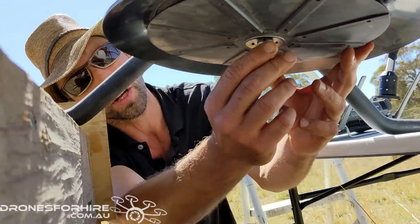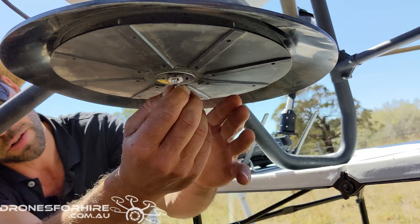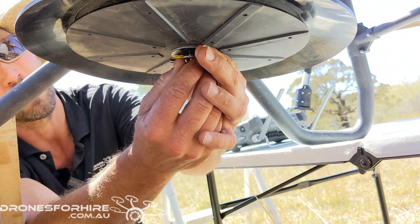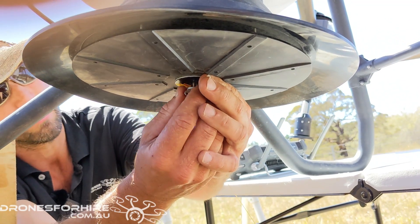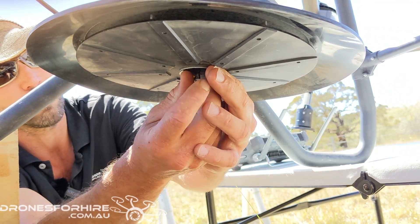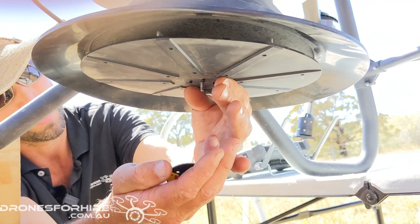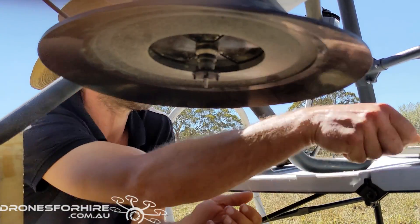You're then going to undo this wing nut. Now the wing nut is reverse thread. When you first undo it, it has a bit of Loctite on it so you may need pliers just to start it — be gentle. This process is a lot easier if you do it before you've put the spreader into the drone. You're going to remove a small washer and then off comes the spreading disc. Just put them to one side for now.